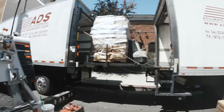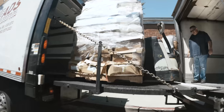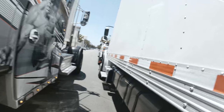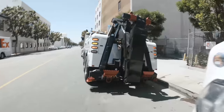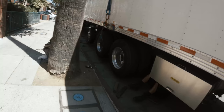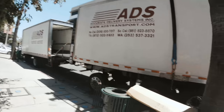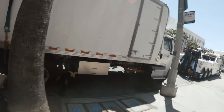That's the second to last pallet. After this, there's one more. I'm gonna offload it directly. And Hulk's job is done. Got Joe underneath here taking off the drive shaft right now, since he's about ready to tow it. And remember that picture earlier with all that gap on this side? We got some wood here from our tow trucks, and we're gonna do a bit of cribbing. Once it's empty, I'll probably raise it a bit more to get a better gap, and we'll just throw in some wood. It should have no issue at all because it's empty now. But to prevent that leaning, throw in some wood and a strap, and it's 100% perfect, ready and safe for towing.